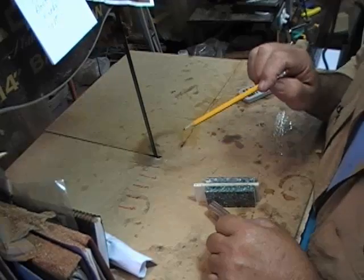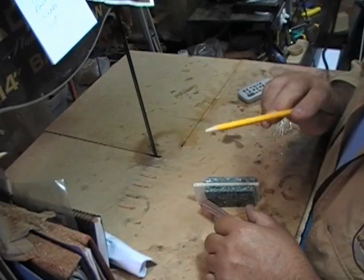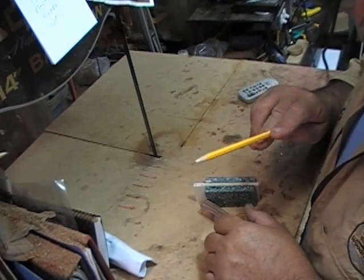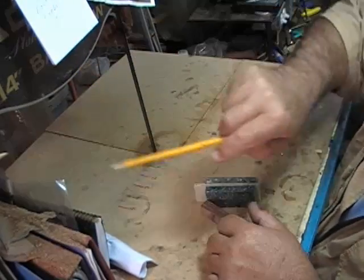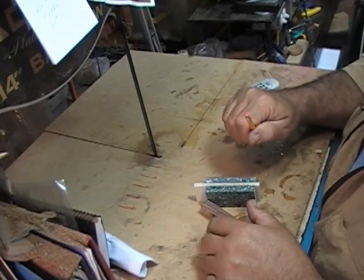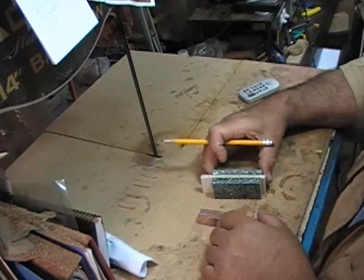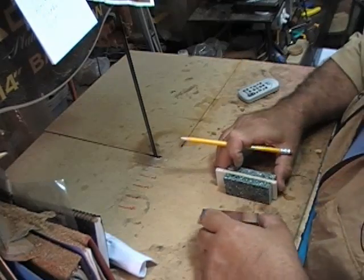Oh, what you heard just now, in one of my earlier tips, I showed you how to put a bypass or a secondary switch on your saw that turns on both my lamp back here and my vacuum cleaner. Every time I turn on the saw, I reach around the side, hit the switch, and both things come on. I get more light and the vacuum.